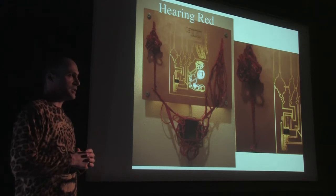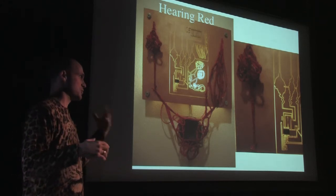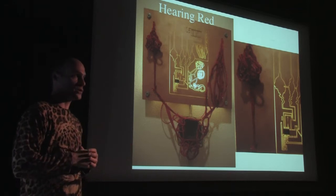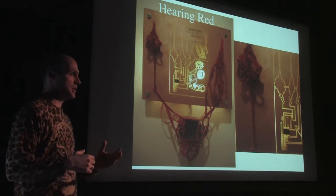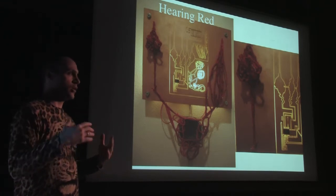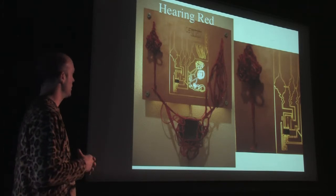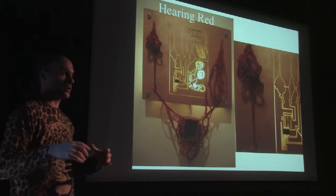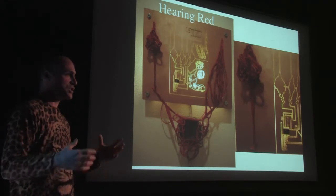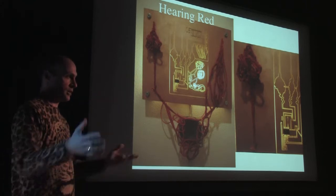What that actually is, because of the way video is constructed, you have one high-pitched sound that's, because we're using NTSC, about 15 kilohertz, towards the top limit of your hearing, and then one that's at about 60 hertz, which is on the low limit of what you hear as actually a tone. Not quite at the bottom, but it's near the limits. We were thinking about this quote from John Cage, where he was talking about being in an anechoic chamber, where you get no sensory input whatsoever, and you start to hallucinate. So you float in this thing, I guess everyone knows this.